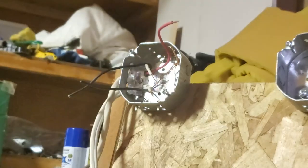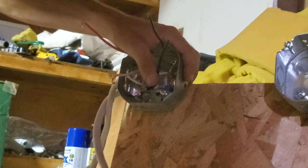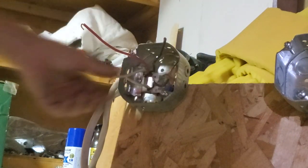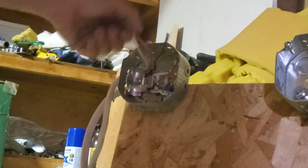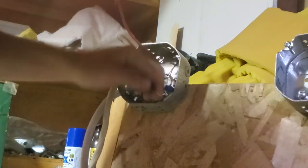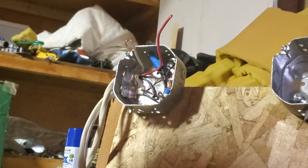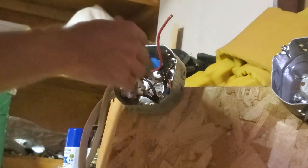You're going to be twisting right because that's how your wire marettes are going to twist. Got little holes in there for making loops, so with the terminal on like that, it pulls with the loop. Cap my safety first. These blacks are just going to travel through down this two-wire down to that plug — it's going to be my power. I'm going to be dropping neutral off for the red here, and then with that other terminal it's going to carry it down through to my plug, sharing those neutrals. If you're removing the device, you take your hot off first, then your neutral, then your ground. And putting it back, the reverse — start with your ground, then neutral, then hot, so that you're always maintaining safety.